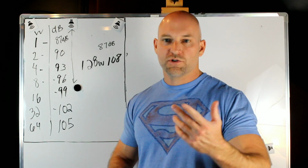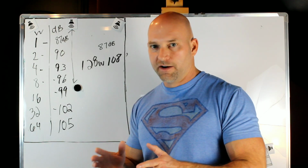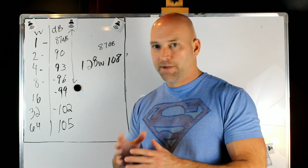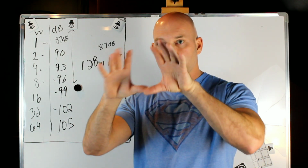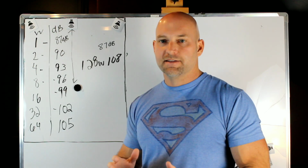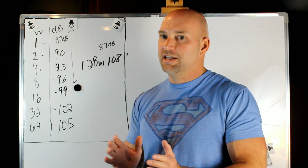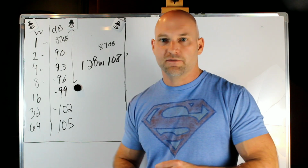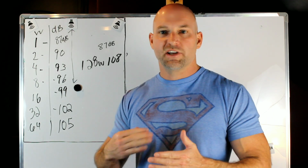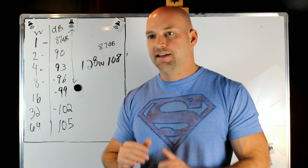And one reason is when you're trying to push 7, 11, 13 channels on the onboard amplifiers of your receiver, that's stressing the power supply of the receiver quite a lot. It's one power supply trying to push all these separate amps that are built into the receiver. So I still like to use separates if I can. But the point is, if you're only using like 8 watts, then you probably don't really need it. But if you get up to where you're stressing it, getting towards the max of each channel's capability, 50 to 60 watts a channel, you may want to start looking into separates just to kind of ease the load off of your receiver. Not saying it's a must, but you need to look at that and make that decision for yourself.